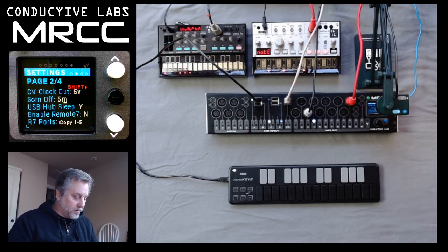However, on the MIDI side, we are not resetting the timer when there's a clock event or an active sensing event. So those two MIDI messages will not reset the timer.